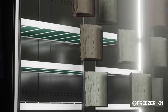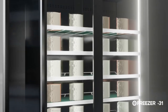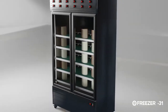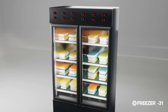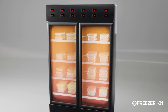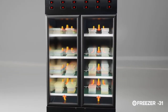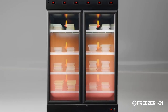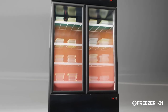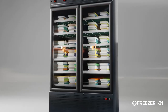Operation methods. First, clear all dust out of the anti-germs freezer using a blower and normal cleaning with a soft cloth to clear the dust. Second, arrange the books for freezing and drying stabilization process. Clean the books before loading into the machine using a blower or soft cloth. Arrange the books perpendicularly or symmetrically between the rows of books. There must be enough passage for air passing after the completion of arranging books, documents, manuscripts, or whatever the materials to be treated.